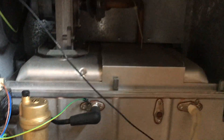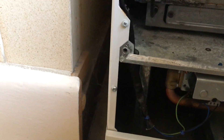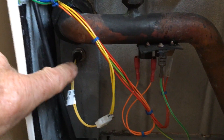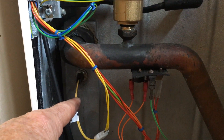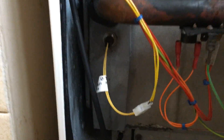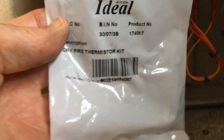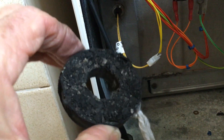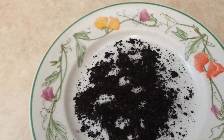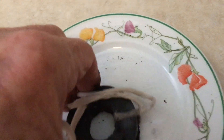I decided to give it one last chance. As you saw on the other piece of video, I took this dry flue thermistor out — obviously turn the electricity off before you touch any of this. The thermistor was absolutely full of crud and the pins were corroded, so we replaced it. We got masses of debris out of it using our magnet, and you can see it was all iron.